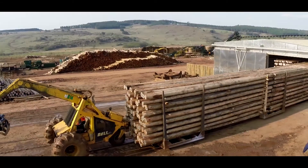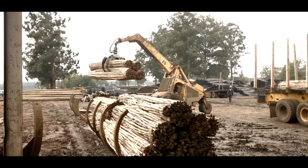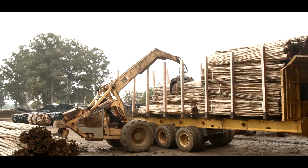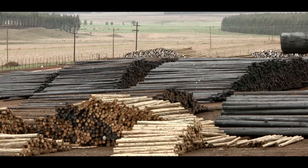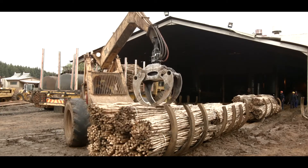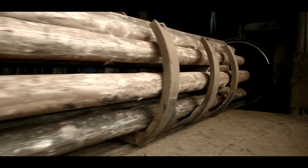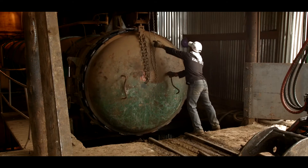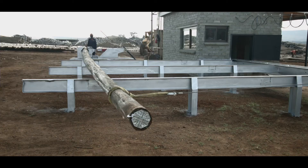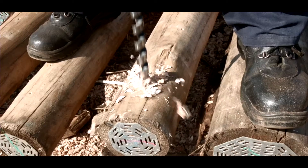The process of kiln drying also sterilizes the poles, ensuring all fungal spores are killed and that the shrinkage of the pole from drying is done in a controlled manner, causing smaller cracks around the pole. The smaller cracks will also assist chemical penetration into the timber. Treating timber that isn't properly and adequately dry could lead to numerous challenges and defect products. The pole is also treated with the correct amount of preservative so that it will not crack after treatment. The timber will be treated with either creosote or copper chrome arsenate, also known as CCA. The minimum temperature for the creosote while under pressure is 80 degrees Celsius. Strength testing occurs in sample batches once the drying process is done. If requested, the poles are then individually drilled prior to treatment.